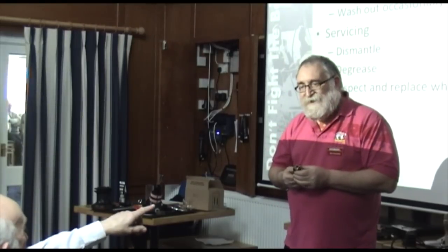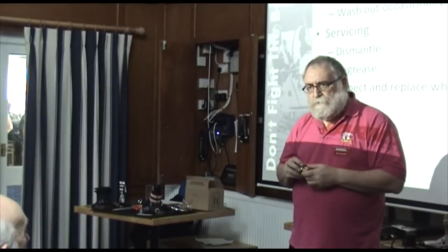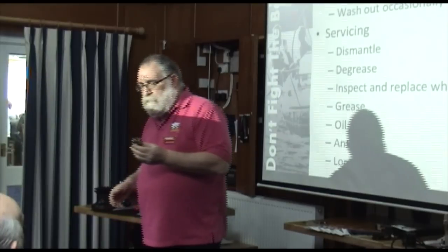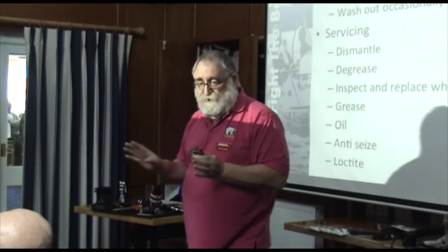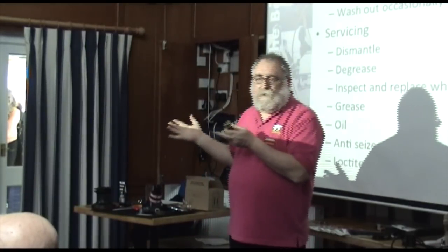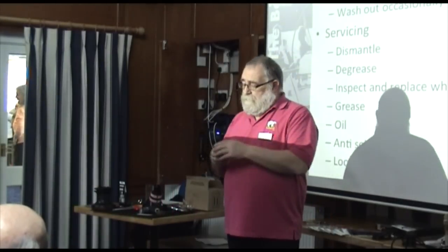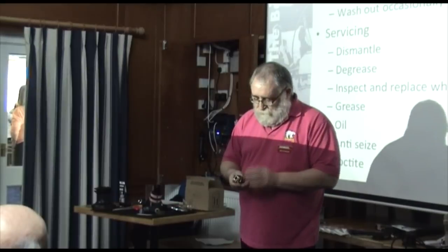I find frequently, maybe once a season, the springs break. Really? Who made those winches? Anderson. Yeah, but the springs. I presume the springs and pawls are fairly standard. No. Absolutely not. You buy the packs. For Harken winches they're the same, but Harken springs and pawls are not the same as, say, Brandel. Although they look very similar, and if you really try hard, you can get them in. It ain't going to work very well though. And they're not the same as Hanson either.